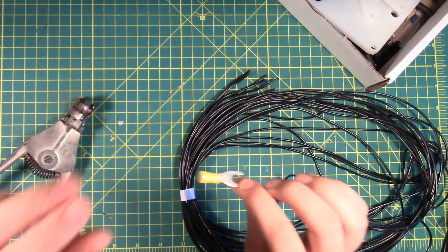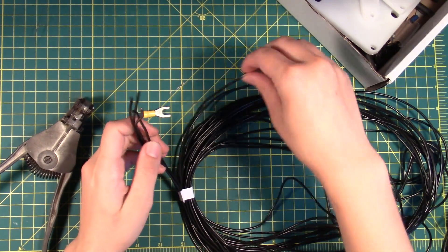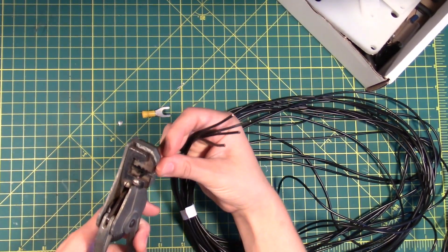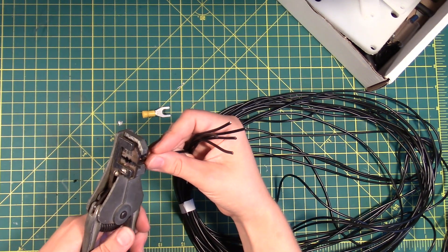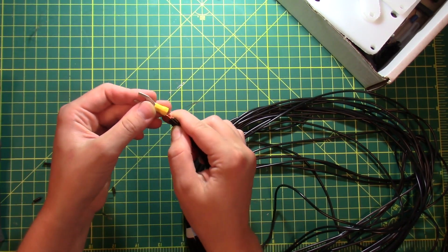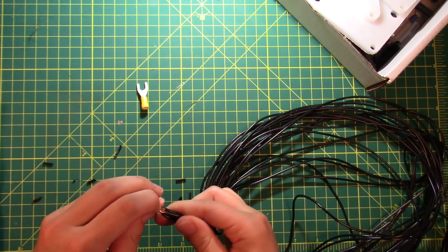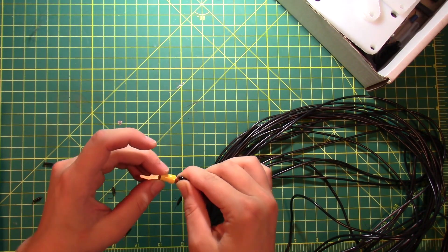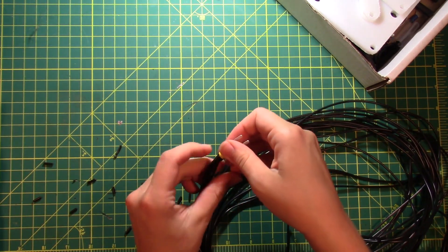The next step has to do with these little fork connectors. The yellow ones go for the radials and the blue ones go for the elements. The yellow ones are obviously bigger because you're fitting six wires in there — and make sure it's six, please — because you do not want to know the headache I went through when I accidentally put five in and crimped it and soldered it. Also, I forgot to crimp these, so if you have the crimping tool, do it. The first thing you have to do is use the wire strippers. I didn't take off enough, so you'll see me take off a little bit more. Then I just lined them all up, twisted them all together, and put them through the fork connector. This would be the point where you would crimp it to create that mechanical connection.